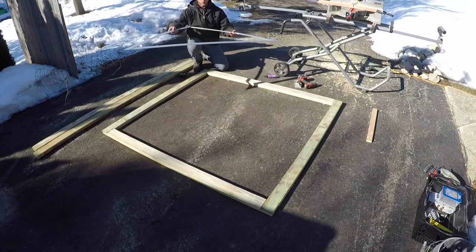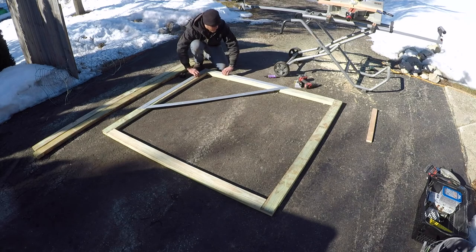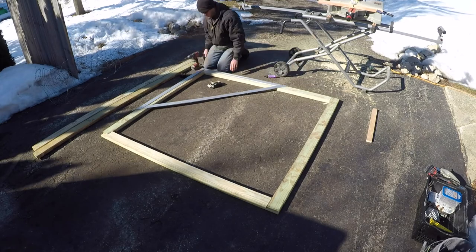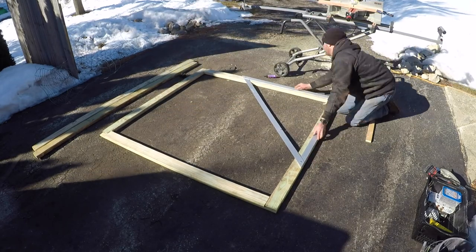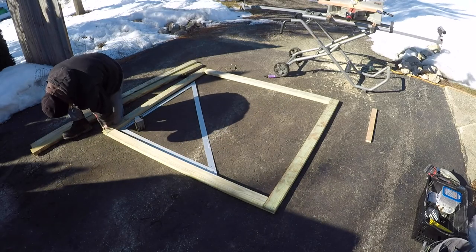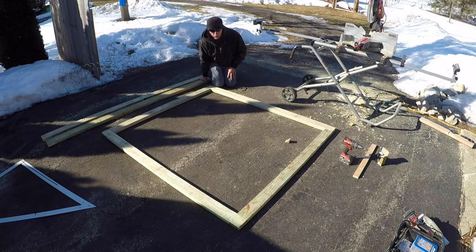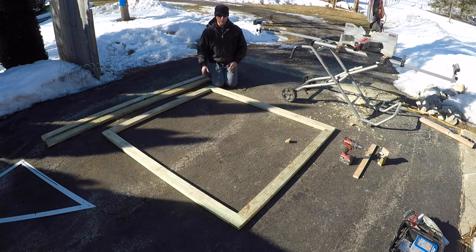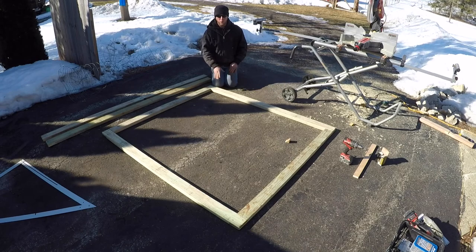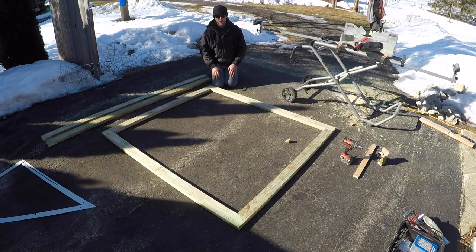I'm going to be using this super large foldable 3-4-5 square — works great for this type of stuff, or any type of squaring up flooring or whatever you need to do where you'd normally have to measure. I could probably leave a link in the description if you're interested — it's not exactly cheap. As far as cross bracing, that's going to depend on how big your gate is. As you saw on my last gate I only had one brace on it and it worked perfectly fine; I'm just going to add another one to hopefully alleviate some of that flexibility.